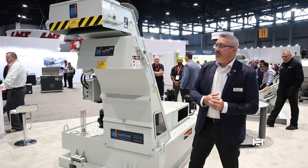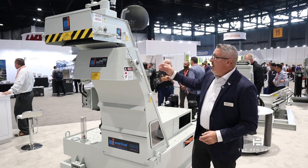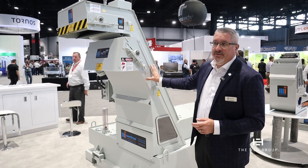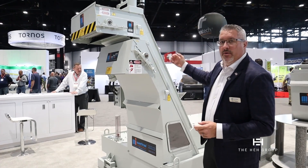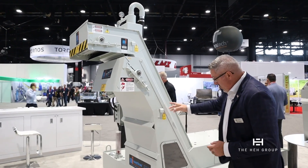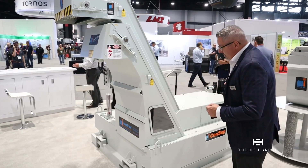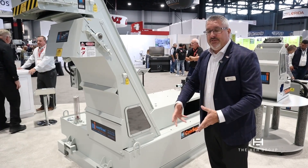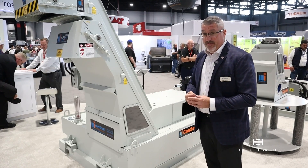One of the biggest features, what separates this, is you've got a top conveyor up here that carries out the big chips. It's a basic chip conveyor, and then on the bottom you have the separator conveyor. What happens is the big chips come out, the small fines drop inside of this bottom conveyor. There's a pump connected to the coolant tank that sprays coolant through a filter panel, and that continuously keeps the coolant suspended, cleaning that filter panel down to 50 micron.